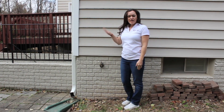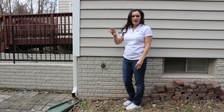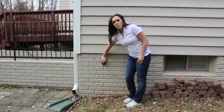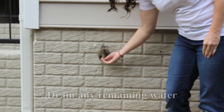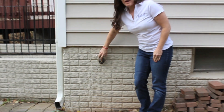After you have the inside hose bib valves closed, you come outside and open the valve completely — lefty loosey, this is all the way open. You want to make sure that any remaining water drains down, and then you can go ahead and close it back up.